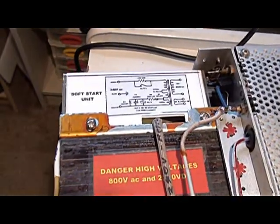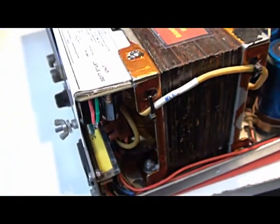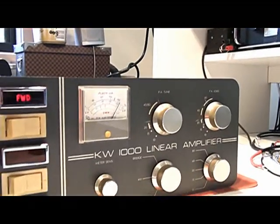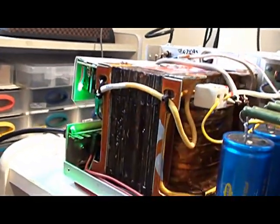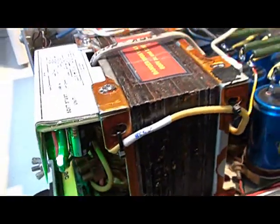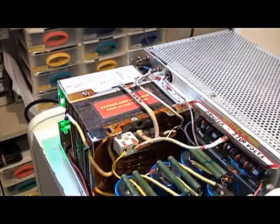I've made some warning labels — one for the power transformer, and one I've put over the tag strip down the bottom, just to remind me that there's 240 volts down there. The label is now attached. I've plugged the power back in and can turn the linear on. The meter switches to the high tension, which is around 2200 volts. Moving around to the back, you'll see the LEDs on, telling me the relay is energized and shorting out the soft start resistor.